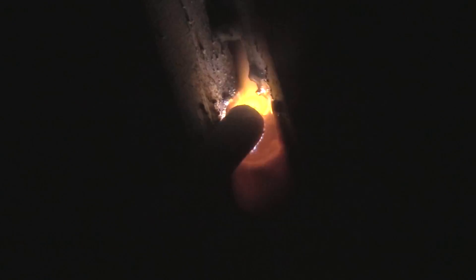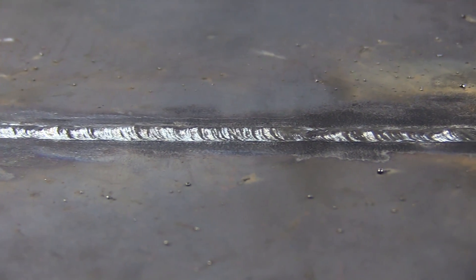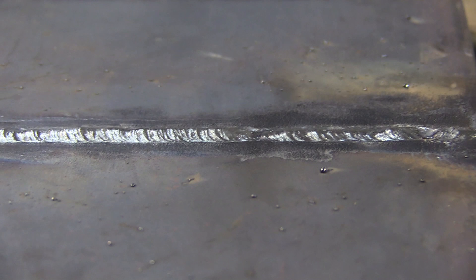The way to get it right is to feather those restarts and feather those tacks. As Andrew comes up to the final tack on the plate, he's keeping that rod poking through all the way until all the fire is coming out back. On pipe you'll have longer tacks and a longer run — key point, make sure you have enough rod to go into that tack so you're not stopping prematurely and causing a crater inside the pipe. The root won't look good on the outside — you're going to have to grind it. The procedure calls for grinding the root pass slick. The main thing is to get the right contour on the inside, the right reinforcement, no suck-back and no lack of fusion or penetration. That's the root pass and all for this video — we'll do the hot pass, fill, and cap in another video, and then move on to 12-inch open root pipe with the same rod.